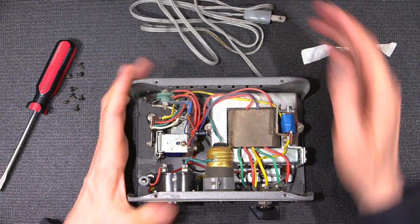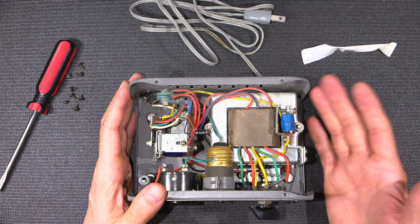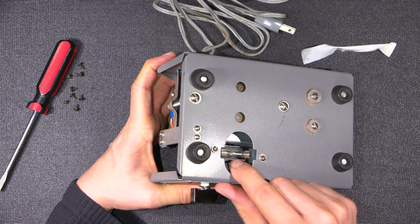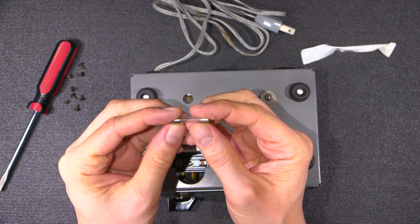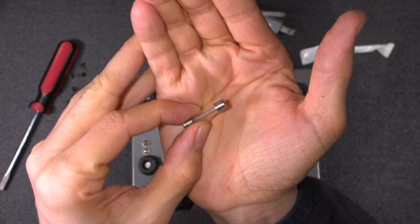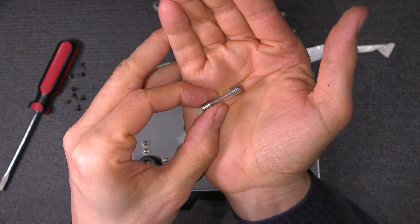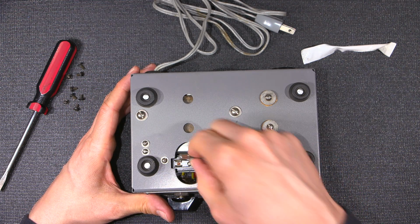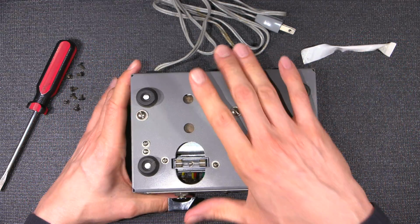current limited supply attached to this thing. So if there is anything wrong inside this, say the transformer has a short in it or something like that, you see the cover missing to a fuse and you see a fuse rating of, what is this? 3 amps. So it's rated for 200 watts, but there's a 3 amp fuse in there. Right, there's a warning sign, so it may have an issue. You know, the reason that the fuse cover is actually missing. So I'll just put this in here. It doesn't matter because it's going to be attached to a current limited supply anyway.